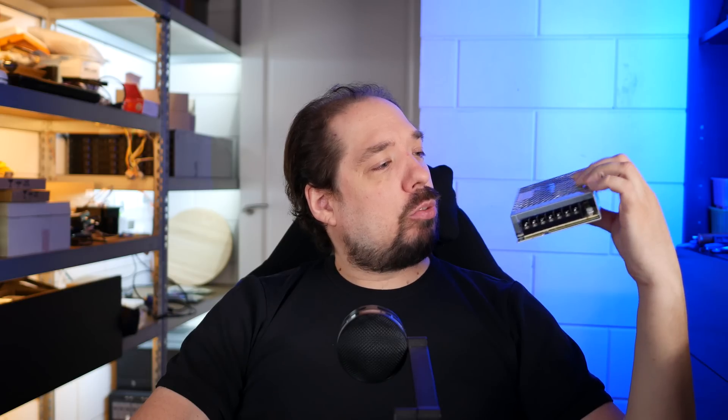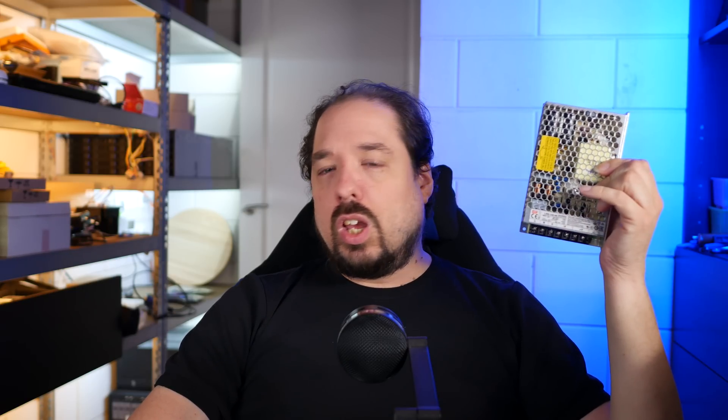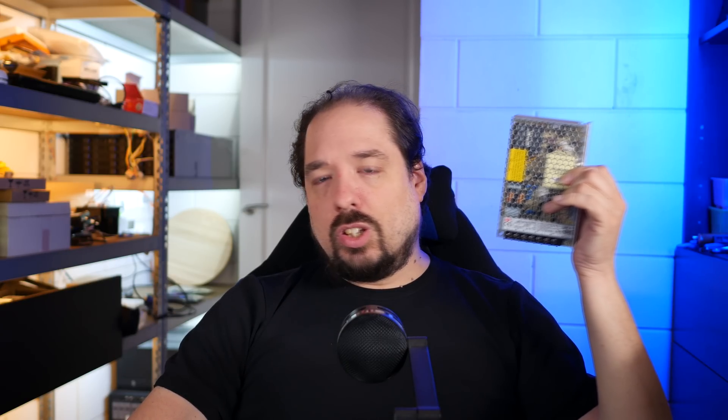So this video serves more as a tip. If you have a device which was working fine before but is now exhibiting strange problems like lockups, reboots, slowness, or something else — check the power adapter. I replaced it with another 48V adapter I had, and I purchased a Meanwell LRS 48V series, 150 watts, to run the POE injector and maybe one or two other devices. These are generally a lot better quality than this Chinese adapter. It's three times as expensive, but I think it'll last three times as long and at least not cause these weird problems.